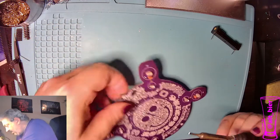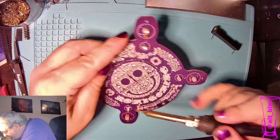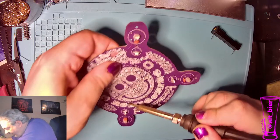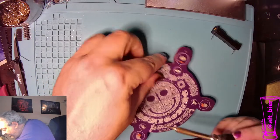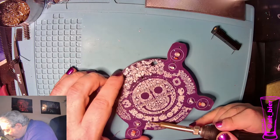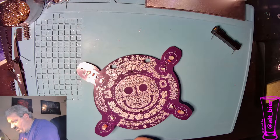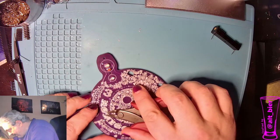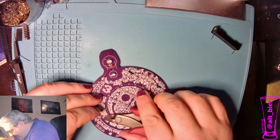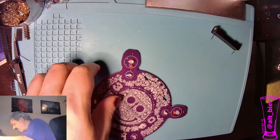This one got a little too much solder on it, so a little trick I have when I get too much solder on something like this is we're going to heat it up, and instead of using a wick or anything like that, I'm just going to bang it, and you can see there's the extra solder I don't need, and the rest of the solder that's there looks fine now. Good. Let's trim those pins. Those are tough like header pins.